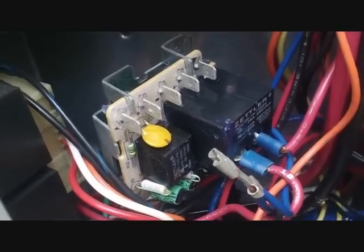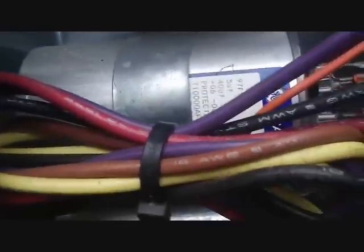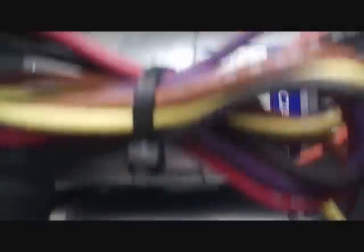I actually replaced this relay a few years ago, but there was a storm that could have caused it. Down in the low-voltage compartment there's a bunch of water, which isn't going to help anything. Inside you can see a defrost board, start capacitor, start relay, separate run caps for the fan and compressor, and a transformer tucked away. I'm going to get a replacement capacitor and relay from DNL Parts and come back.